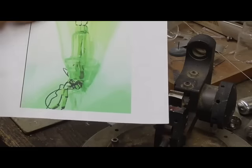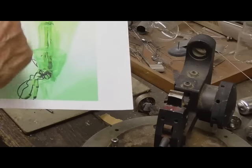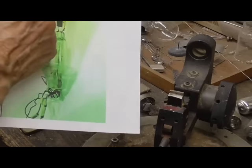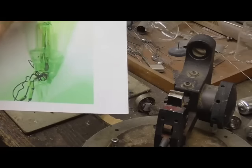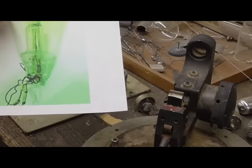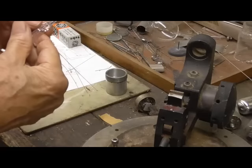air there. I remember the last time I made one of these things, what happened was when I heated the filament, the thing started to warp and it moved over about 45 degrees. So I'm going to put a little support from the edge up to the top. Insulating, of course, but enough to where I can just keep that loop exactly over the plate.